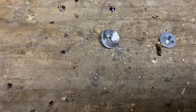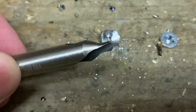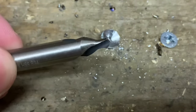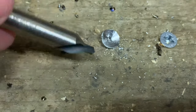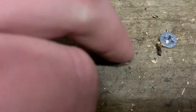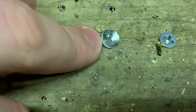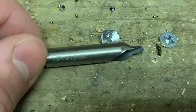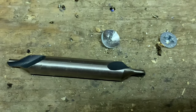What I'm going to do first is go for probably the largest bit, because my theory is that if the actual tip of the drill bit grabs it, it should undo the screw without having to get down to the shoulder. But first I'm just going to clean up this section with a normal right-handed drill bit, because these left-handed bits are a couple of pounds each, while a normal drill bit is pennies.